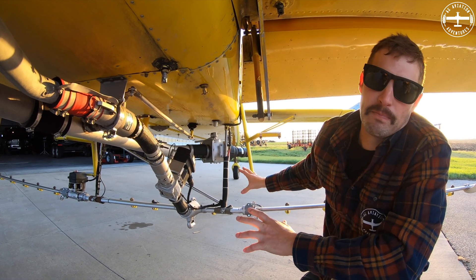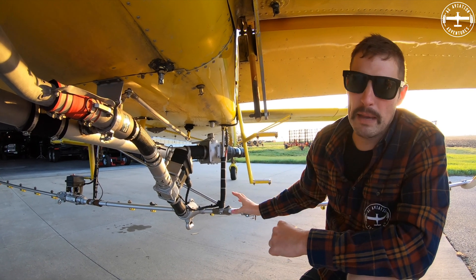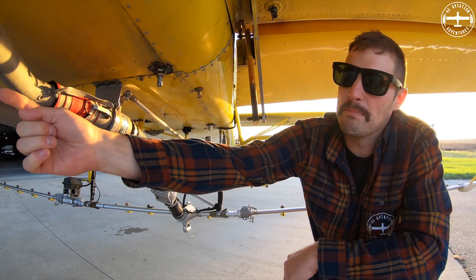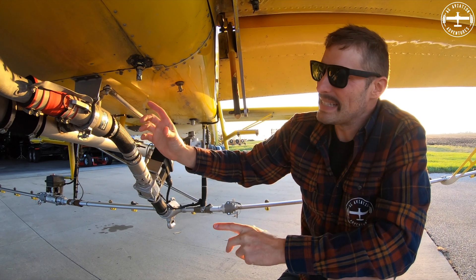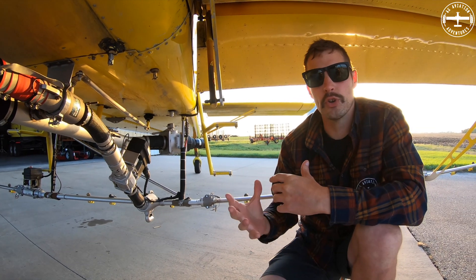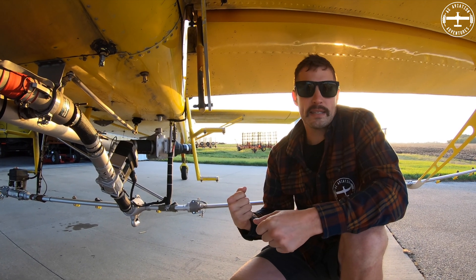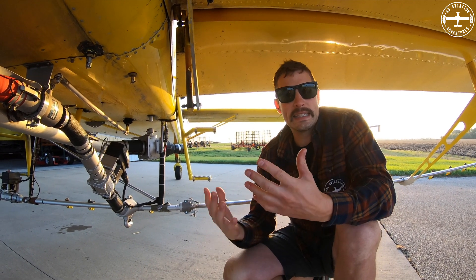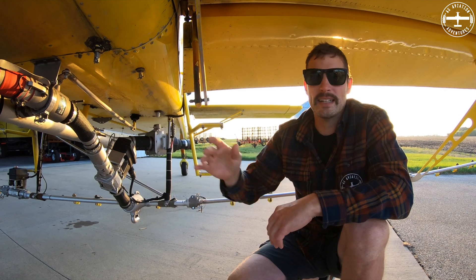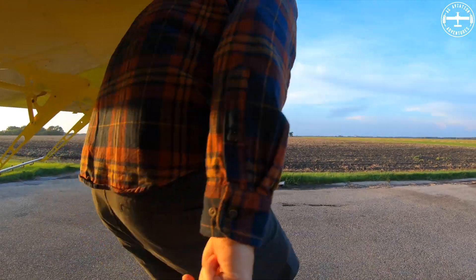What this does when I close that suck back valve is not only shut the booms off, but it actually puts a little bit of negative pressure on the spray booms, because it's taking the water and chemical and diverting it back through here and back into my hopper. When it does that it puts just a little bit of suction on the entire system and shows negative pressure inside the cockpit. That's important because when you shut your spray system off and you're in a turn, you don't want anything leaking or dripping — that's one of two items that helps ensure nothing is going to drip or leak.